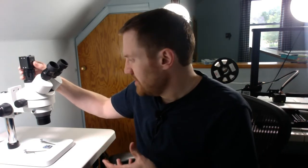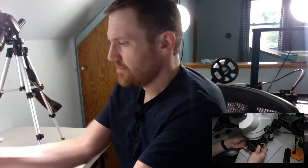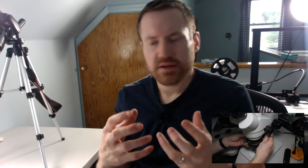I had this previously assembled and was having a lot of trouble getting an image out of the CCTV, so I've been working back and forth with the distributor — she's been very helpful. Part of the reason I'm filming this is to send it to her so she can see how the device is functioning and make sure I didn't assemble it incorrectly. The light ring inserts over the optic on the bottom and three thumb screws tighten it up. Try to bring each side in an equal amount so it isn't cockeyed.